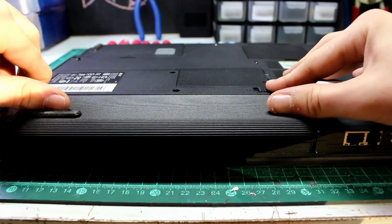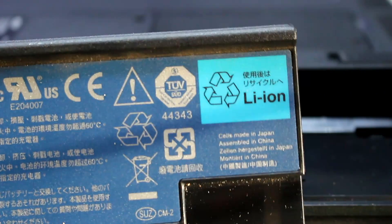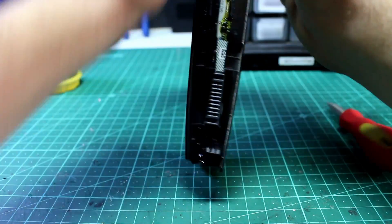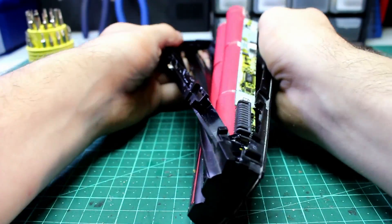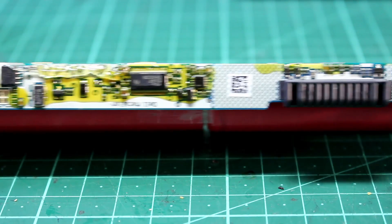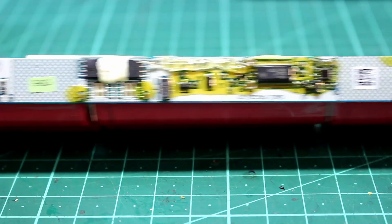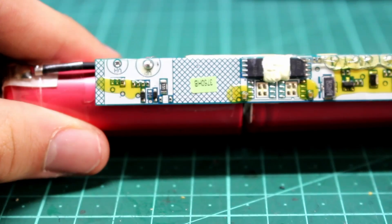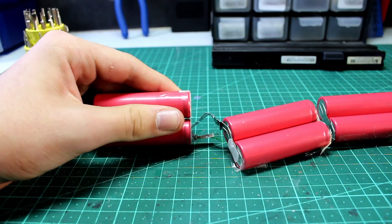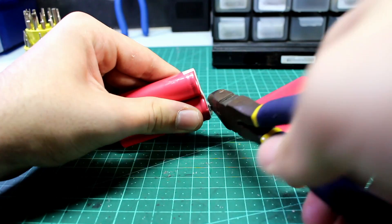Let's crack one of these open. Pull the battery out of your laptop — they're normally removable on older ones. You should see a seam around the battery; wedge a screwdriver in there and carefully pry it apart. Once it's open, carefully pull the battery pack out of its casing. You'll see the battery pack comes with a battery management system. Cut all the wires going to it and slowly peel the metal strips connecting the batteries together — do not pull too hard. If they don't come off, just cut around the edges with some pliers.